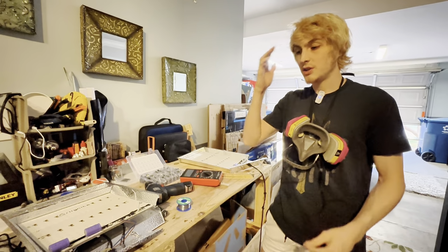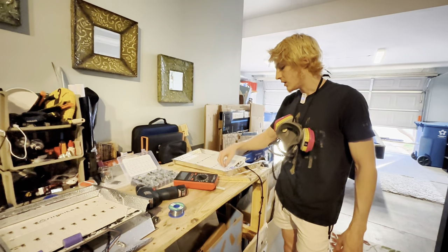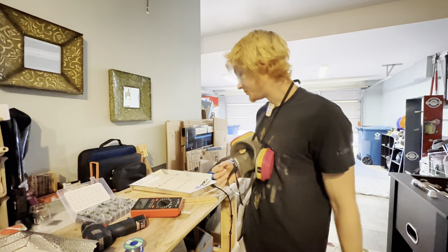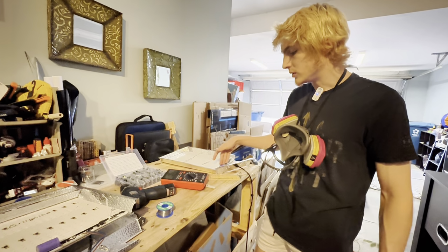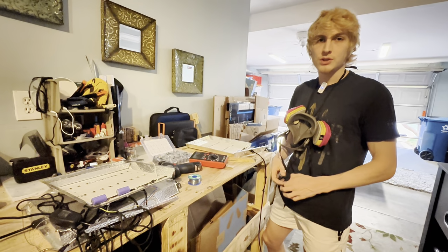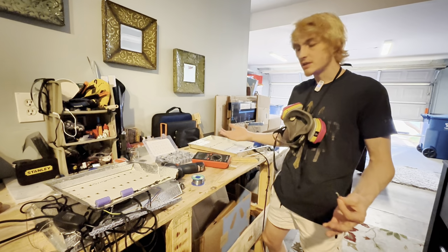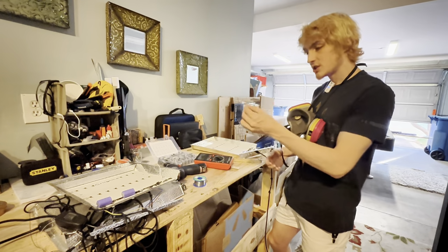If you have some knowledge of what's occurring, these are capacitors. I have, in the past, taken them off. I may have some clips I can show of me testing the purple ones. And not a lot of these were properly labeled. This one is properly labeled and says 470, 10 volt. And just start pulling them off, the ones that are large enough, and testing them. So if that's a 400 volt, 100 microfarad, we would take it off, throw it in, and see under the 200 microfarad range, is it going to 100 microfarad? And if it is, then it functions correctly and we put it back on. If it's going to 20 microfarad, it's obviously not working properly. So that's how I figured out that this was the one that was the issue.